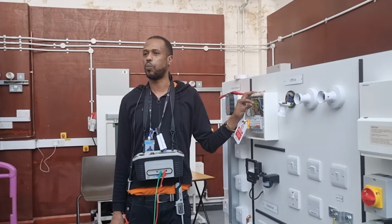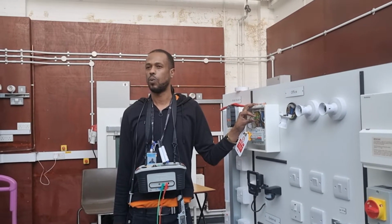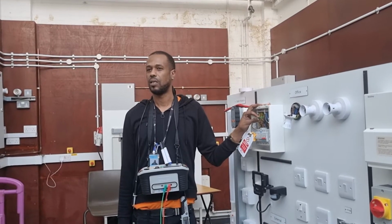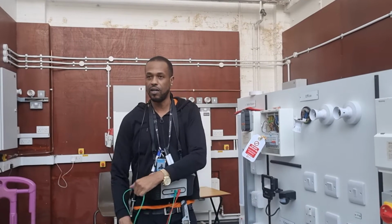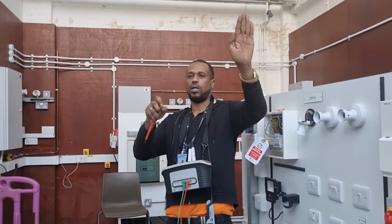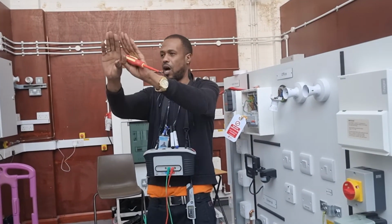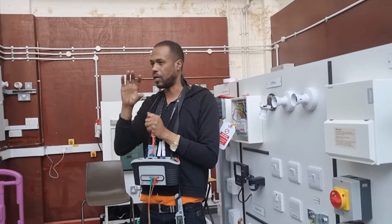Why do you think I'm asking you ZS equals ZE plus R1 plus R2? Does that sound like calculation? So if I gave you a figure, you just told me ZS equals ZE plus R1 plus R2, which I totally agree. If I gave you the ZS figure and the R1 plus R2 figure, could you then work out what the ZE would be? Are you not calculating?